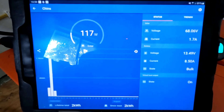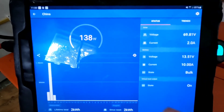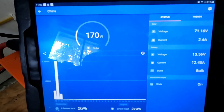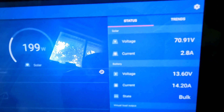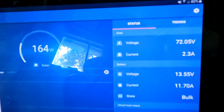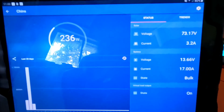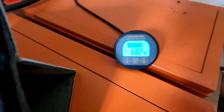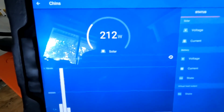The problem was a single panel - and I was just so stuck on the idea that it had to be the charge controller. So here we are on the Victron app: that 500 watt array is pumping in 170 watts, fluctuating as the clouds roll through. Voltage coming through is roughly 70 volts. I got it tied up yesterday, pumped in a ton of power. The system is sitting at about 68 percent right now and it's early in the day, so it should be a decent charge.